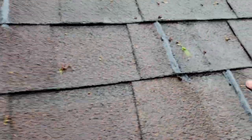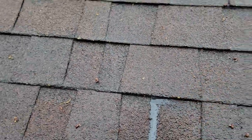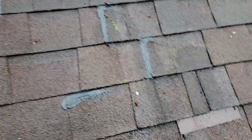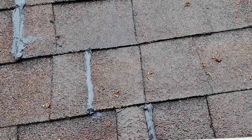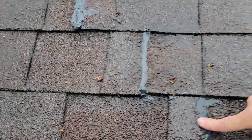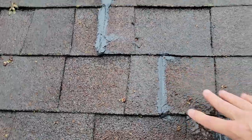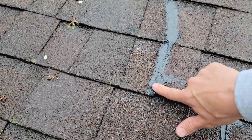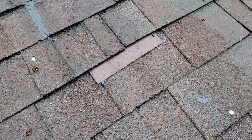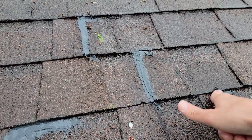This is not a real repair — well, it is for some roofers — but there could be other areas. When you're using some sort of caulking for your roof, you want to make sure one, it's gonna bond, and two, it's not gonna eat or degrade the shingles. Some things you put on your roof will actually eat it and tear your shingle apart. So make sure you're not gonna do more damage trying to stop a leak.